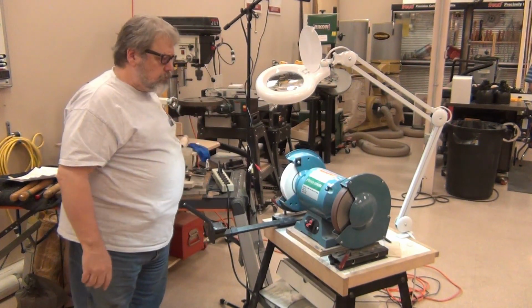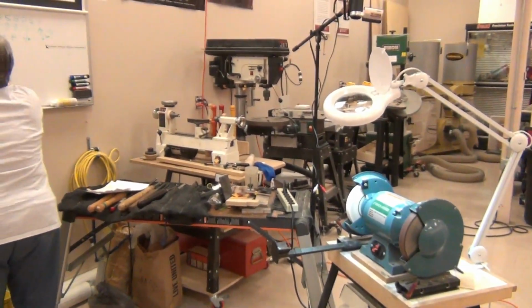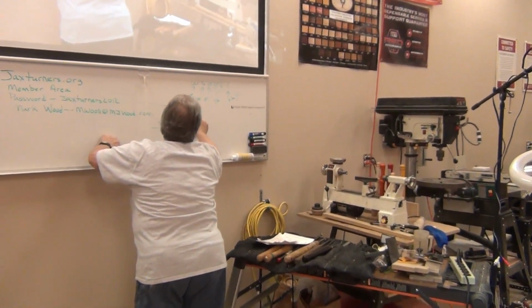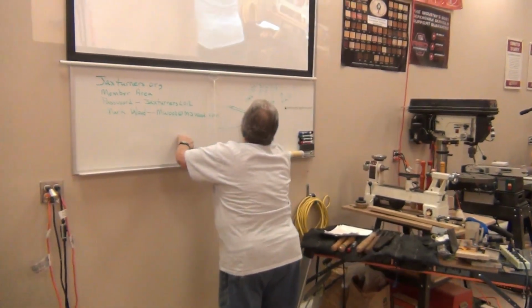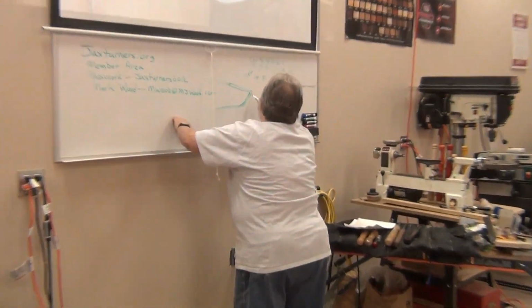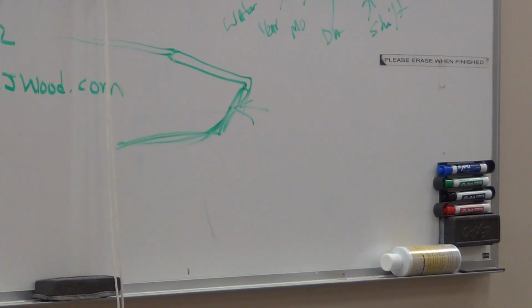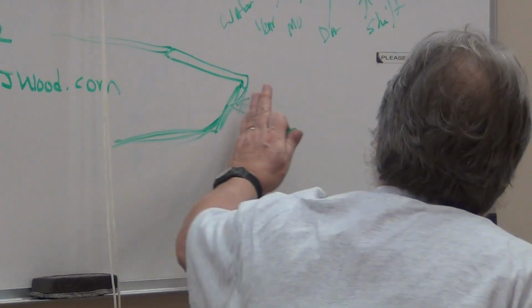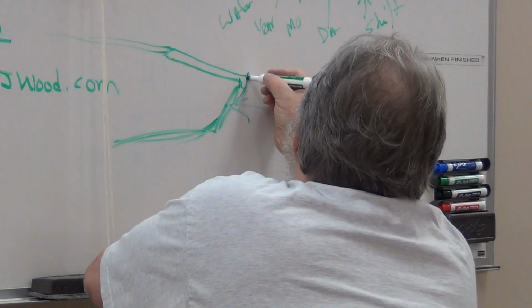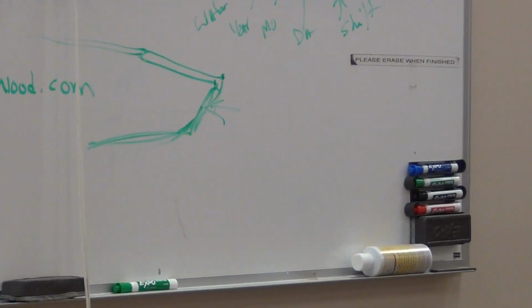And the Nick Cook ones, the top of that, all right, this is actually a U here. So you're only going to sharpen this face right there, all right? You don't sharpen the top at all. You're just taking this back farther and farther because it's a really shallow little U, because the idea with that is it's cutting at these two edges.